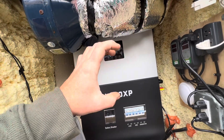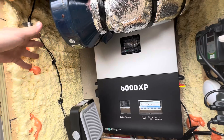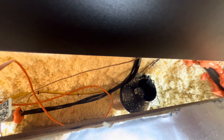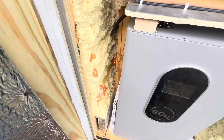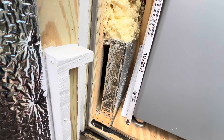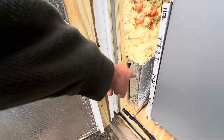This discharges through a spring-loaded dampener, located up here, and this tube goes to here. Very simple. So you don't have any cold backdraft coming in — it just opens and closes. Back here I put a small booster fan, which is less powerful than the one that pulls, so the vacuum is higher. Buried in there is another spring-loaded dampener. During pollen season, you can stick this filter in here. If there's a lot of fine particulate, I told my client to stick this in during those times of the year — it'll ventilate.